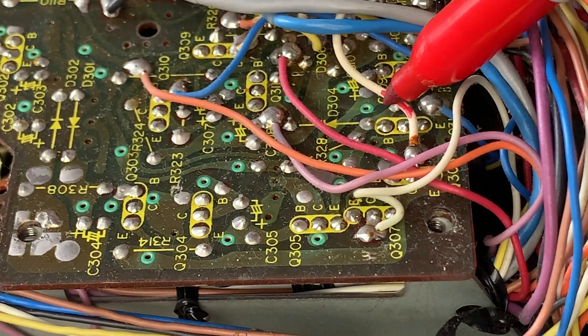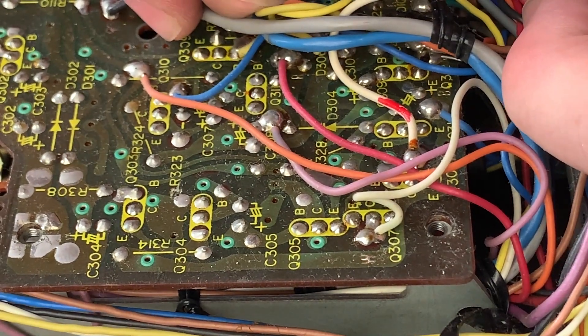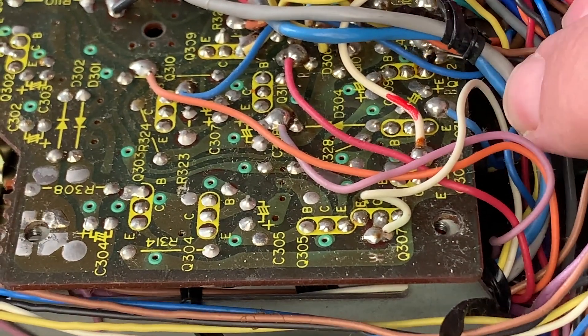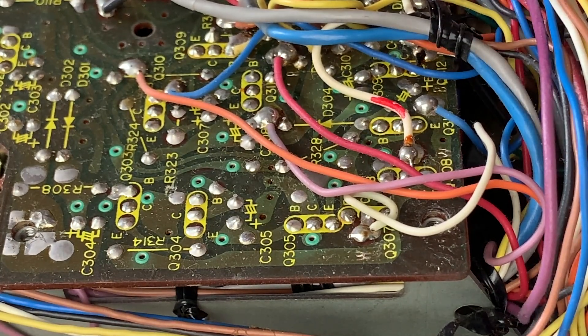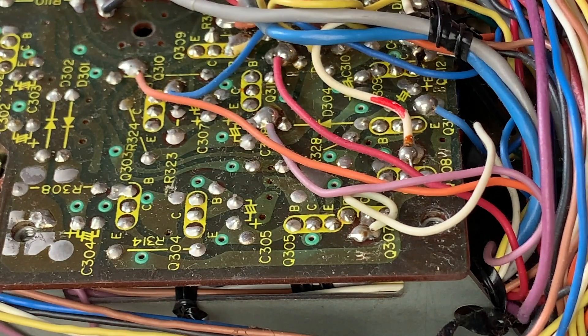Here are your two white cables - I always find it useful to put a color reference on each of those so you know which one goes where. There is a third white lead here as well which you don't normally need to desolder, and there may be a capacitor to unsolder on the bottom side too. It can be quite prudent to take photographs of the board at this stage, or make a little color-coded diagram, just to give yourself a ready-reckoner as to where things go.